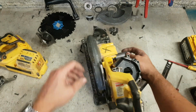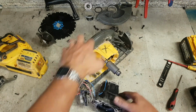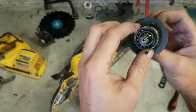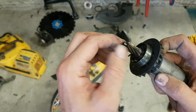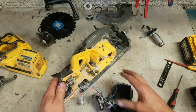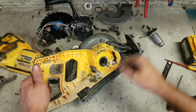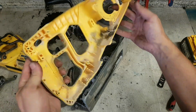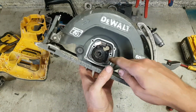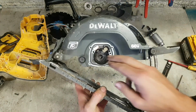That one's okay. And there's our bad bearing. Racing all coming out of it. No wonder she sounds rough. And the amount of damage, teeth are actually fine. So, get that out. It's not screwed on. That will give us all a good clean. Get all the sawdust out of there as well. Clean out this whole gearbox, sorry, because there's debris and metal inside there now. They have to be got out before we reassemble this, otherwise it's going to destroy the gears.